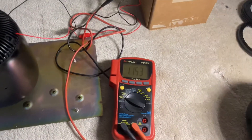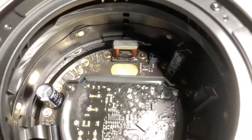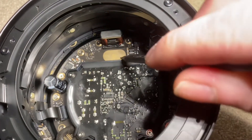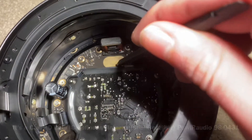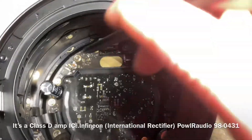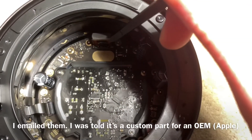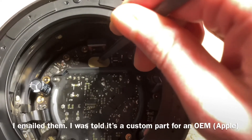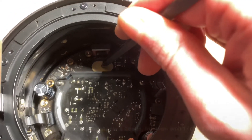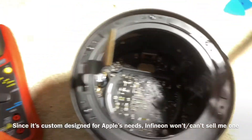Now that IC is on the other side of the board. This plated area right here acts sort of as a ground plane heat sink for the IC. If you were to remove the circular board — 14 screws, two screws that mount it per the tweeter — on the other side is an international rectifier amplifier IC, and that is what I believe is the culprit.